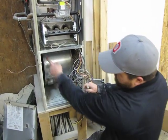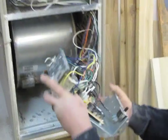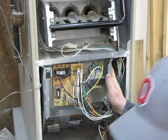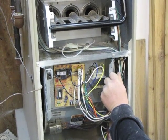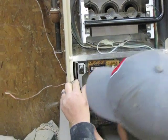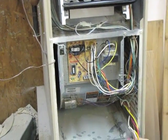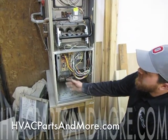After you have the blower assembly screws reattached, you want to reattach your limit. Then you're going to reinstall your control board and tighten the quarter-inch screws. Then you're going to want to rewire the blower motor to the board, doing that as you wrote down or noted the leads. After wiring the blower motor, you want to reinstall the thermostat.